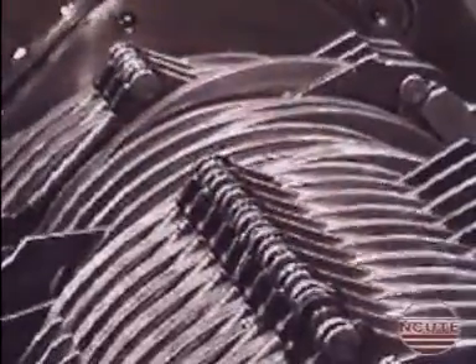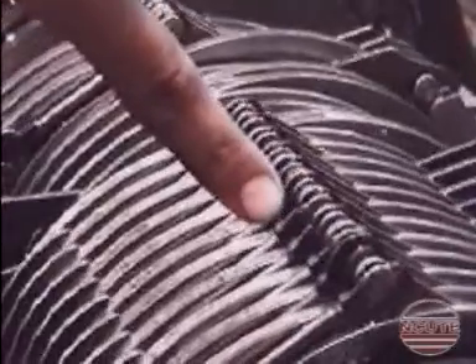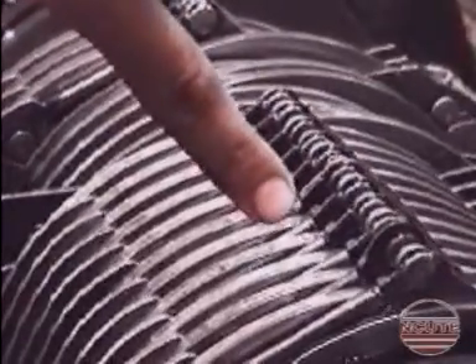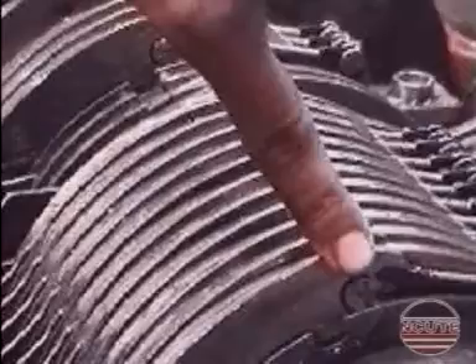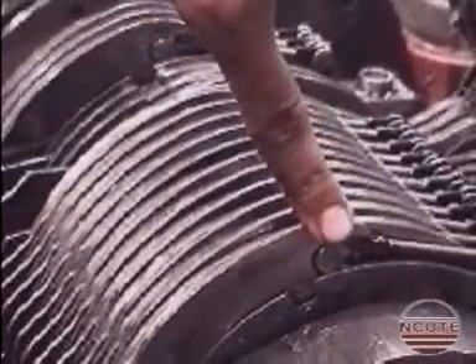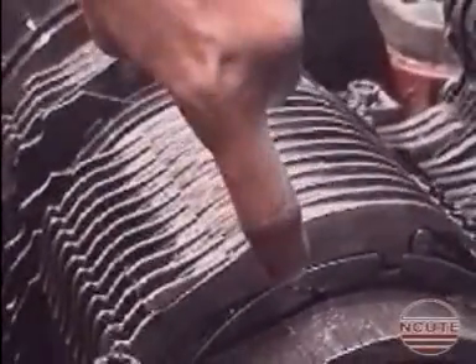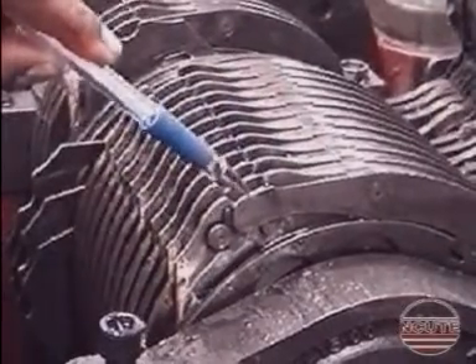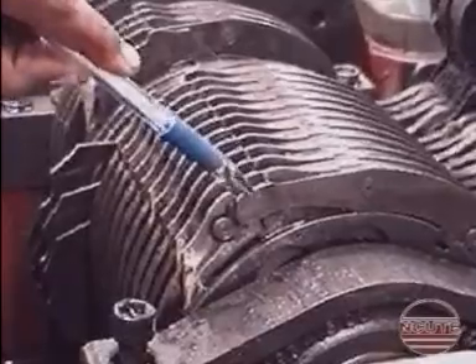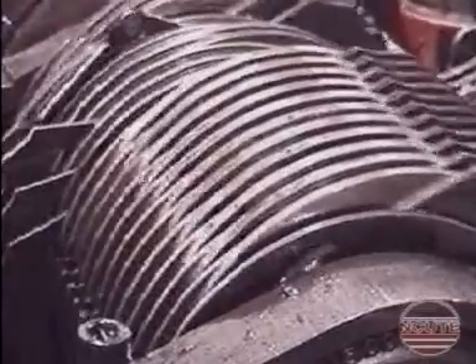Spring-loaded catch mounted on one side of the crank unit connects the coupler ring. Clear view of the catches — the mounting point of the catch on the crank unit is seen here. The two carrier grooves on the coupler ring are seen here, along with the spring connection for the catch. By pressing the catch at this point, it results in releasing the projection from the carrier groove, so the connection between the coupler ring and the crank unit is withdrawn.